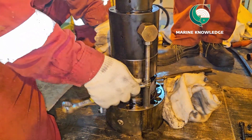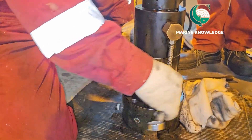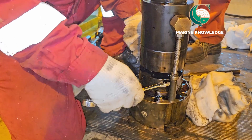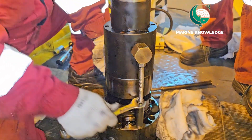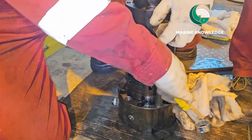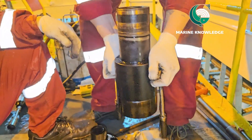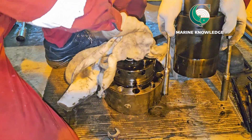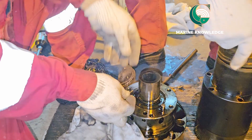It is a bit of a slow process — just lift it and you can disconnect it. Actually, now we are lifting it a little bit easily because we are opening this fuel pump when we are using LS-MGO. If you are using LS-FO, sometimes all the fuel impurities get stuck and it will be a little bit hard to remove. Now you can see I removed it very easily. This is the barrel — the barrel is kept aside. And you can see the top cover has some o-rings and a backup ring.